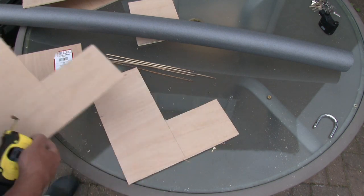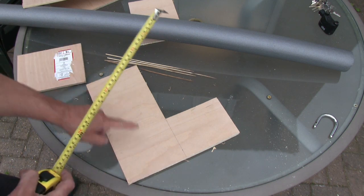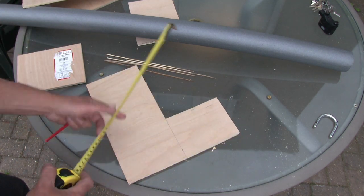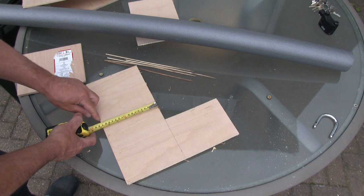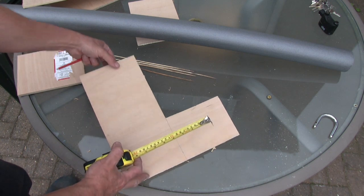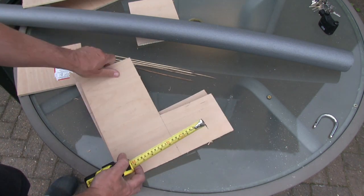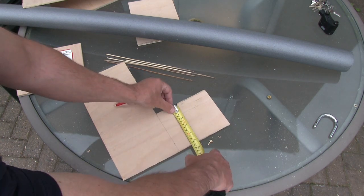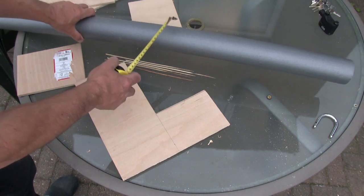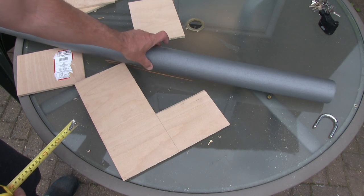For the form we want two L-shaped pieces. This is 35cm high by 34cm long, 17cm wide, so this part as it sits up will be 17cm square. Where the fuel goes, this section is 13cm. Those are the dimensions if you're using pipe insulation that is about 70mm in outside diameter.